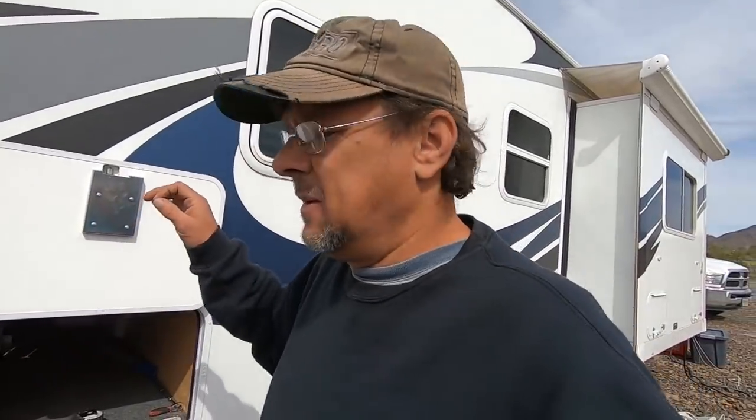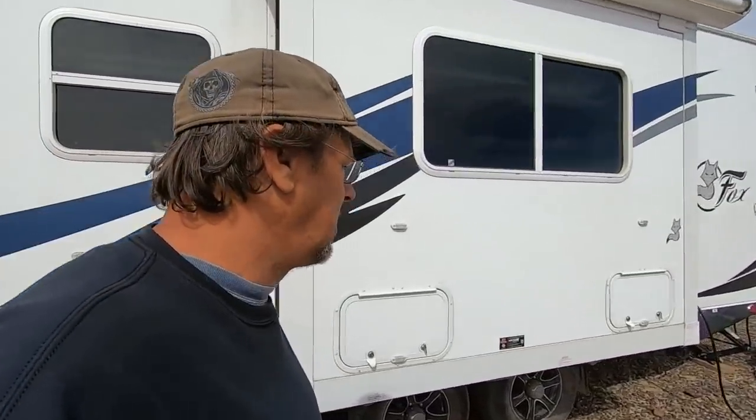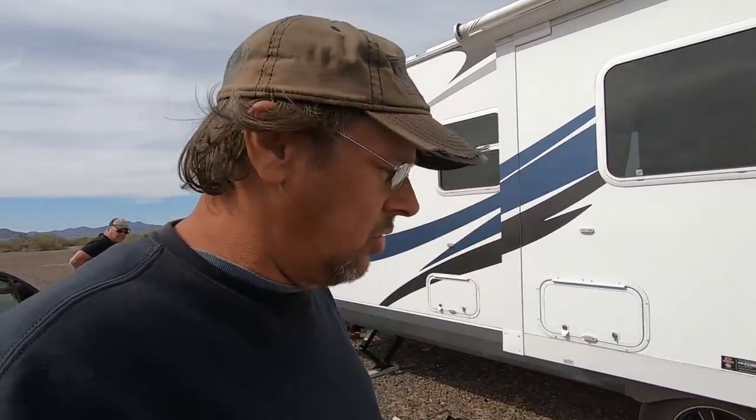When I looked at it, my jaw dropped — that was a fire hazard, that's improper wiring. What he wanted was an inverter-charger so everything would power up. They claimed it was too hard to wire that in, but yet they were able to run two plugs inside — one in one wall, one in another wall — and run an outlet in a slide-out. That's a lot more work going through the walls. It would have been so much simpler, easier, and cheaper if they had run the correct equipment that the customer requested.